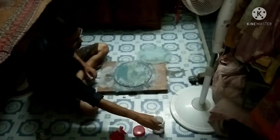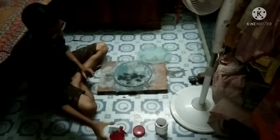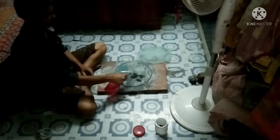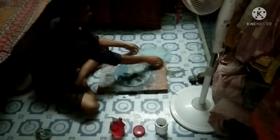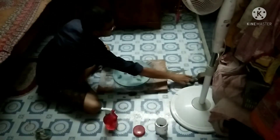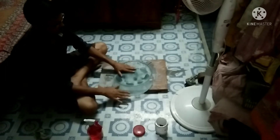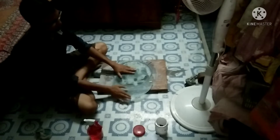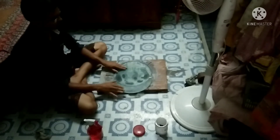After a few hours of grinding at 40% overhang, now I am going to reduce the overhang. This is 80 grit carborundum powder — always sprinkle water, this is very important. Before, it was 40% overhang, that is 5 inch overhang. Now I am going to reduce the overhang to around 25%, that is around 3 inch overhang.